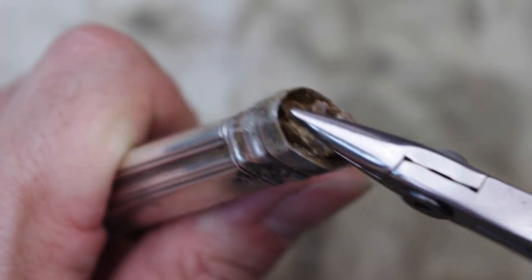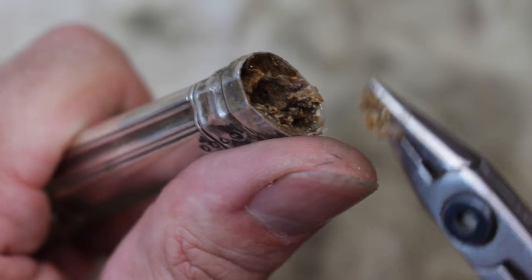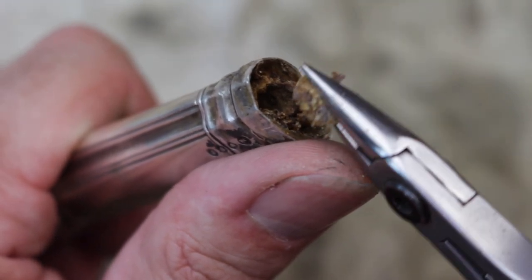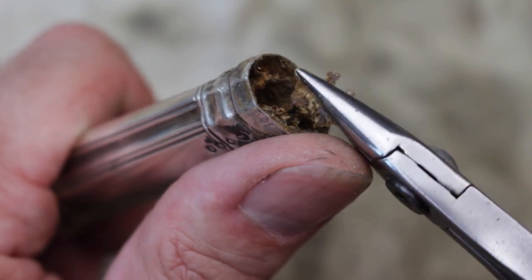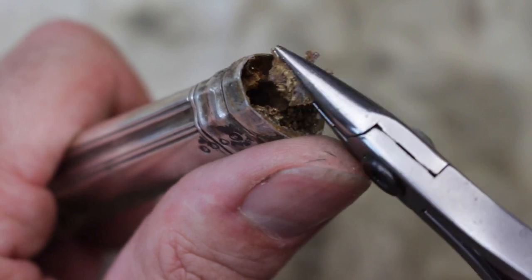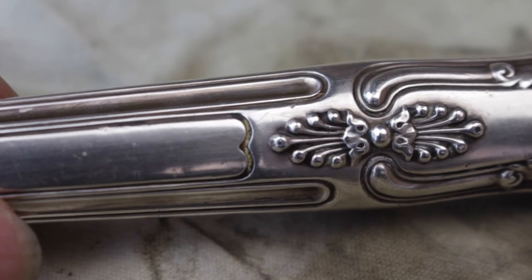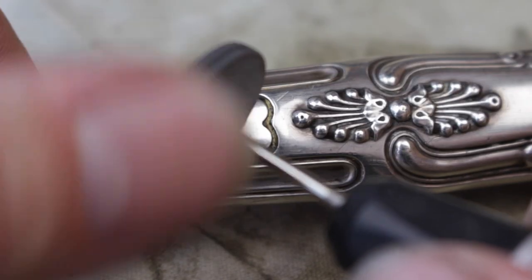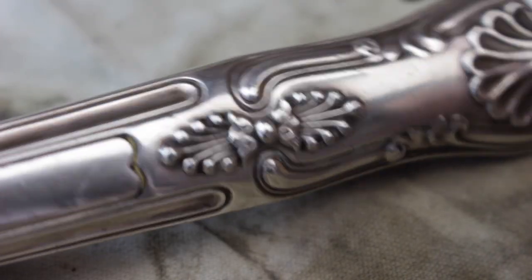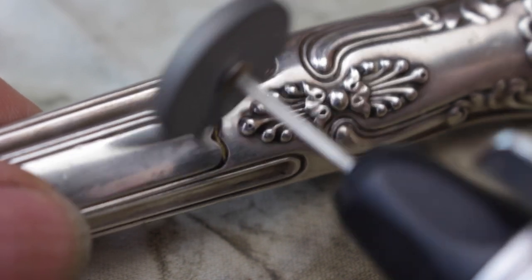Inside the handle I can see a brown, treacle-like material which is like an old kind of resin — shellac. I should be able to set the blade back in just by warming it up and then placing the handle back in. Luckily there are no major dents but just a couple of little scuffs and scrapes, so I'm using a blue silicone rubber wheel, just working my way around it — any scratches or dings, just give a little buff, nice and simple, nice and gentle.